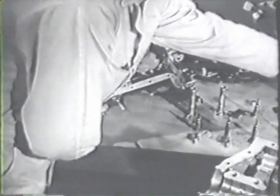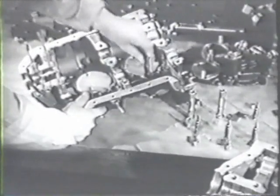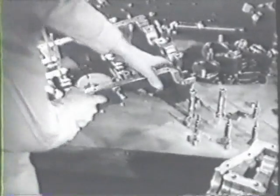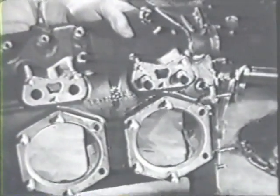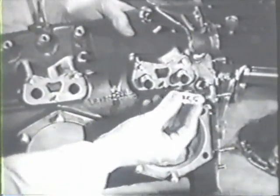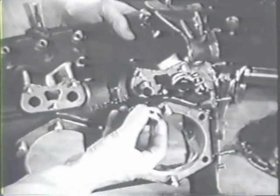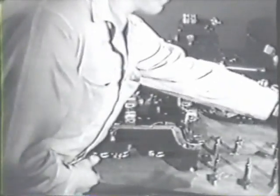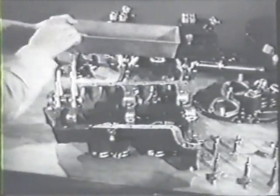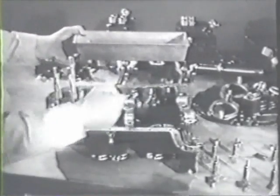They'll remain in place in the 2-4 crankcase, but in the 1-3 crankcase, you'll have to prevent them from dropping out when you turn the case over to install it. You can do this by temporarily slipping a push rod hose connection over the end of the tappet on the outside of the case. Now make sure each of the bearings gets a thorough oiling. Use oil very liberally as you reassemble the engine.